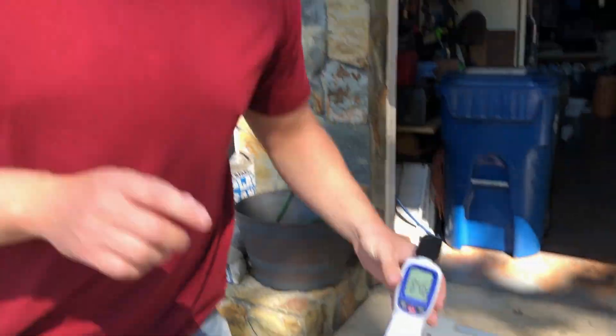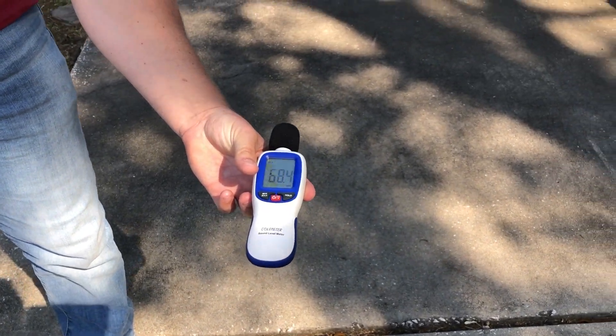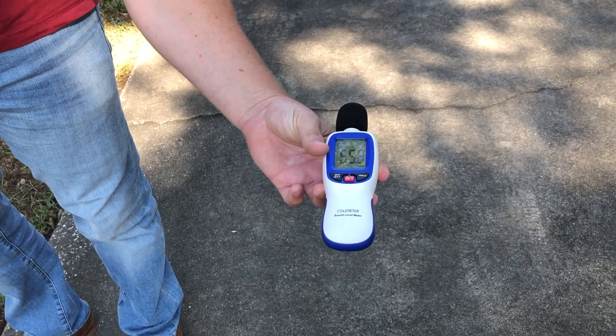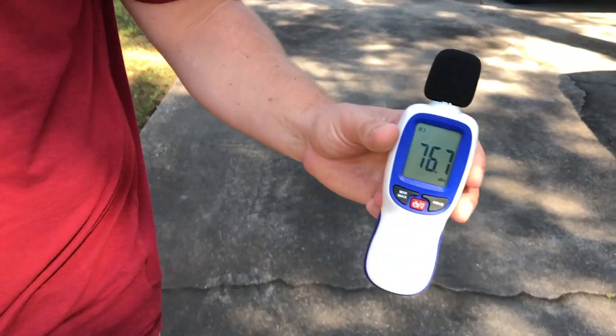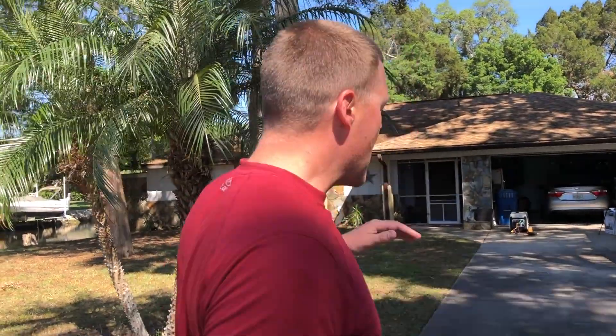84 decibels at the unit, we'll go to 20 feet: 68 decibels. We'll go to 30 feet: 65, 66 decibels. We'll go to 50 feet: 58 decibels — so slightly louder under a load. You can definitely tell with the 4000 watt generator that it is a significantly less load compared to the PG2300 that we just reviewed.